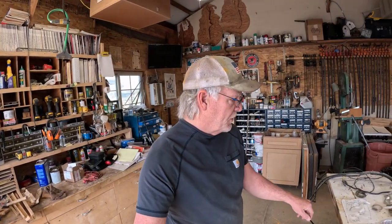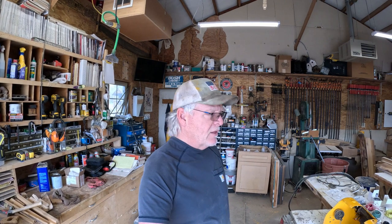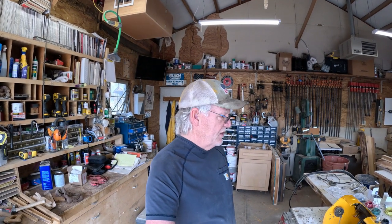I think it has to do with that LED light that we're going to use to help us trick the alternator into charging. Because remember, these came with a generator originally. That's long gone. Voltage regulator is all long gone. So it's had an alternator on it this whole time. We're going to utilize that system. But there's a couple of tricks that you got to do to make those alternators work properly on these old tractors that turn at such low RPM. So stick with us and we'll get this thing going.